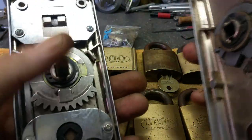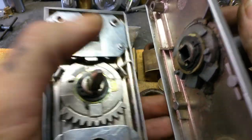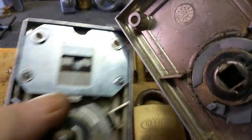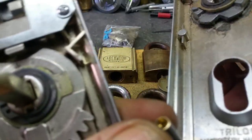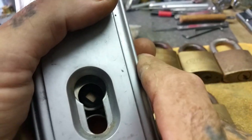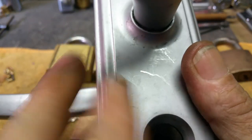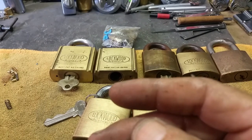I'd need to rebore that hole correctly, which wouldn't be a problem as the furniture is big enough to hide it, but I didn't want to get caught in traffic - so not today. I've got no doubt I'll come back anyway as that's not going to last long. What I did was blow the posts out from about 8mm to about 10mm, giving me a couple of millimetres of play on the furniture, which pretty much got everything lined up to the point where the handle works. I warned him I can't guarantee it since I didn't fit it, but we'll see how it goes.